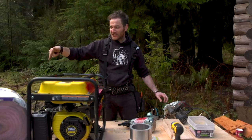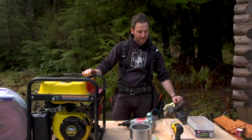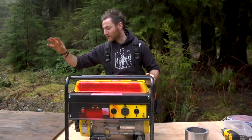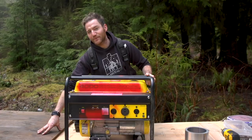We're gonna need some insulation, pressure-treated plywood — half-inch or three-quarter inch — a straight edge or a level, some flashing, your drill, your framing gun, two by sixes, nails, screws, pencils, utility knife, duct tape, and a circular saw. Basically the house is gonna consist of walls and a little roof. The walls are made of two by six, and the roof and walls are also made of pressure-treated plywood so it can withstand the elements.